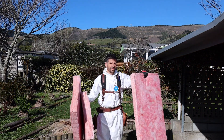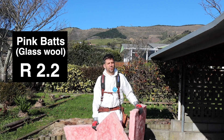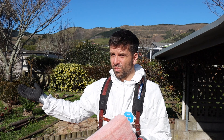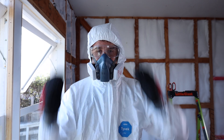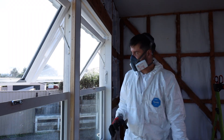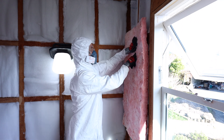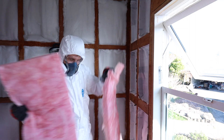The sun's shining and this is my insulation — this is Pink Batts, which is like the most common brand here in New Zealand, and it's R2.2, 70mm wall insulation. In order to maintain our air gap we need the thinner insulation, and it was harder to get — I guess people don't do this often. I'm not a great fan of glass wool insulation; clearly I have to wear my mask and keep ventilation up. But the benefit of glass wool is that you can get a higher R-value for a thinner insulation, and because of that and availability I'm using glass wool insulation.